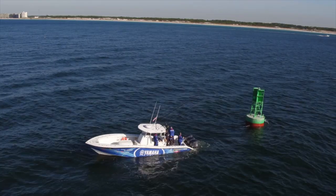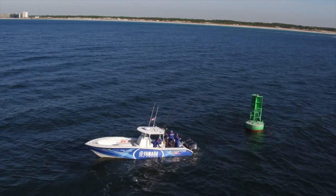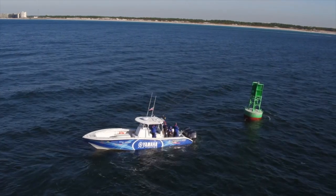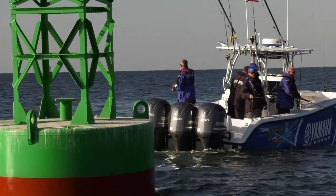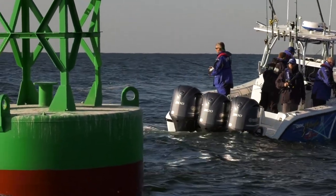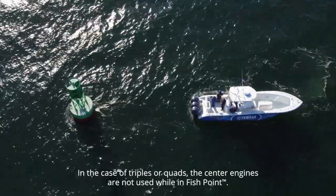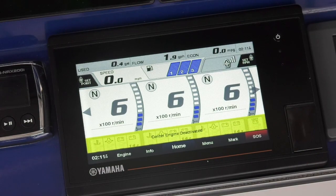By using the wind and/or current to help stabilize the boat's lateral motion, Fishpoint maintains your position using minimal RPM — typically just in-gear idle — and only forward and reverse thrust to keep the boat quietly oriented in the direction you've selected. In this mode, you'll notice that the outboards do not articulate. The Helm Master system simply uses the outermost outboards to provide thrust to twist the boat into position using the stern as the axis point. In the case of triples or quads, the center engines are not used while in Fishpoint — you can manually turn them off to save even more noise and a bit of fuel.